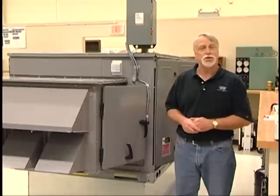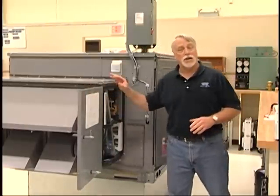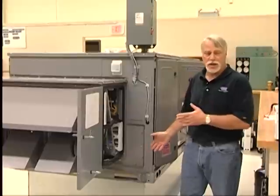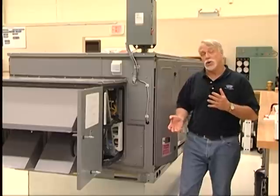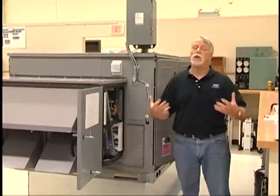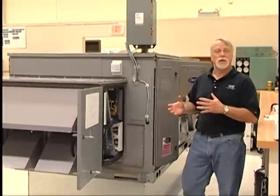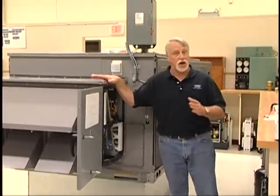This particular machine is equipped with Carrier's Energy X heat recovery wheel, mounted on the end of this down-shot machine. It contains energy-absorbing desiccant wheels. This allows us to retrieve heat from the return air during the heating season and preheat the incoming air during very cold outdoor temperatures. It also allows us to recover and pre-treat very hot air during the summer cooling season, pre-cooling that incoming air, which allows us to use greater amounts of outside air while still running this machine under normal operation — saving energy and allowing operation through a much broader temperature range.